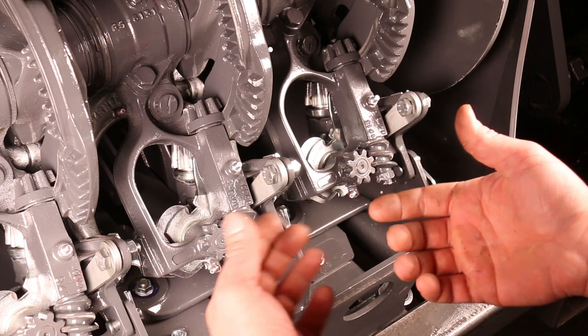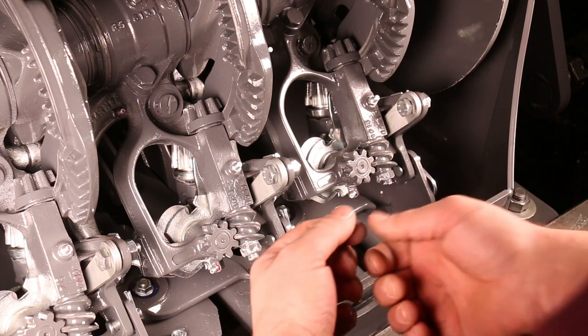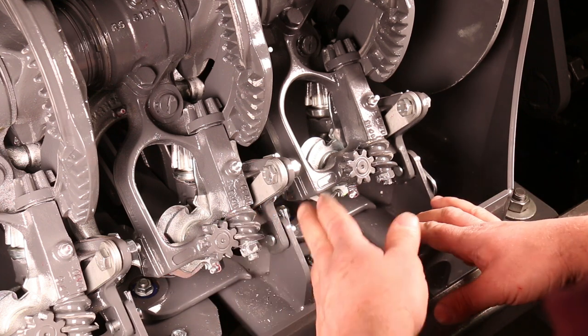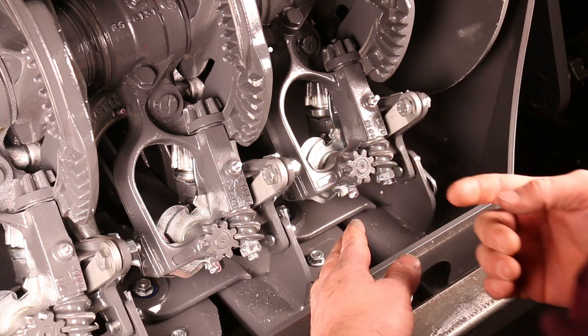You can actually see the knots pull apart once the bale is out of the back of the baler. If it's too tight, it'll pull apart while it's still in the machine, and then the next knot it makes will mess up.